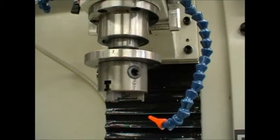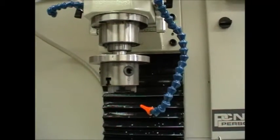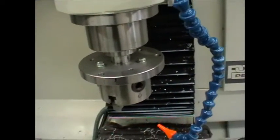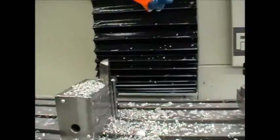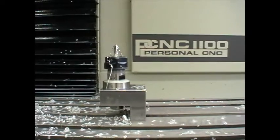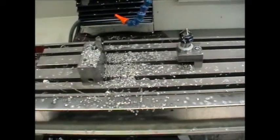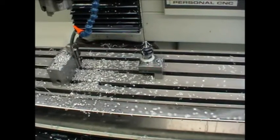I've mounted a small special three jaw chuck onto a back plate I've made up with an R8 shank, using an R8 cutter holder and a screw cutter steel disc as a back plate. This operation is doing some diameter turning, mainly facing and generating some chamfers, then moving to the second station to put a little spherical hole in the end. The beauty of using the mill for turning is you could have many different tools — a big gang plate with 10 or 20 different tools.